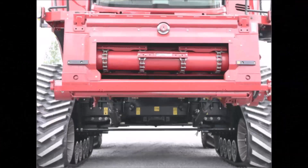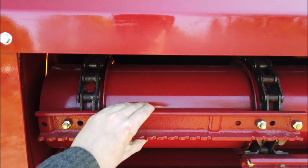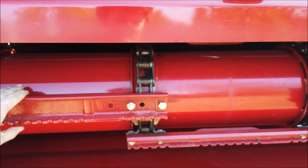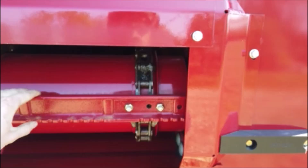To achieve even feeding into the single rotor design, the feeder housing is relatively narrow. It consists of a four chain system with cast slats uniformly mounted in groups of three across its width. The front roller is allowed to float away from its stops depending upon the bulk of material, while at the same time keeps enough weight on the crop mat to ensure consistent crop flow.